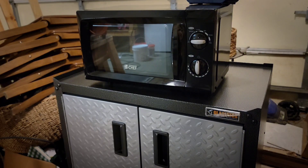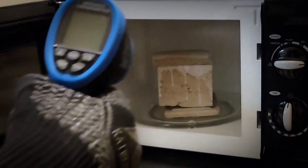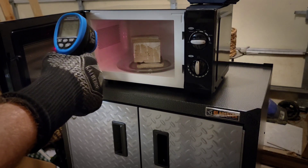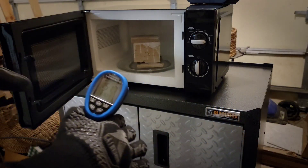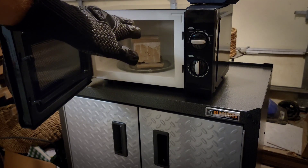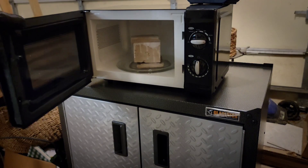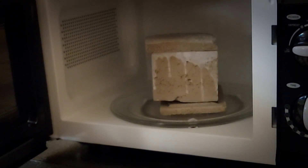I'm going to check temperatures — I have gloves and protective eye gear on. The crucible is sitting at around 200 degrees Fahrenheit, which is very reasonable to manage with these gloves. That's a total of four minutes from the original run. Steel needs to go up to about 2,200 degrees Fahrenheit to sinter properly, so we're going to try to get up to that point.